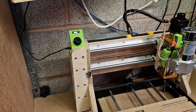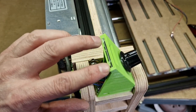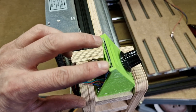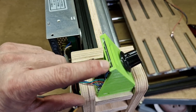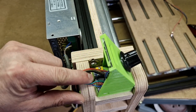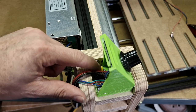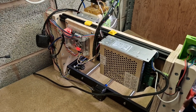The screen just slides in the top here through a little slot in this 3D printed part that I've made, and obviously displays through the window. I've just used a couple of blobs of hot melt to help keep it in position. The actual Arduino Pro Micro is down underneath here with a little plastic clamp at the back holding it in position, and the USB port of the Pro Micro just comes out the side — that's where it gets its power.